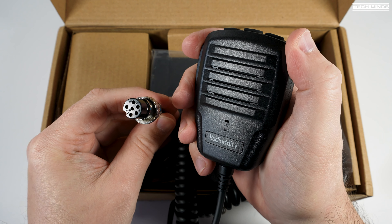The CB500 is quite a compact size, which makes it attractive, along with a nice backlit LCD where you can actually change the background color within the menus. For those in the United States, there are seven WX weather channels available when put into WX mode. These receive around 162 MHz, so I'm not entirely sure how that's going to work when you have your 10 meter antenna plugged in.